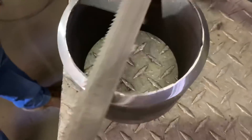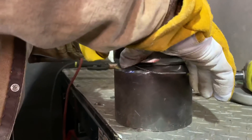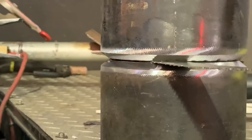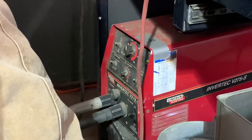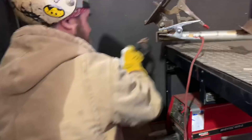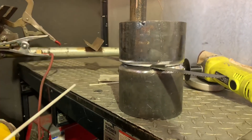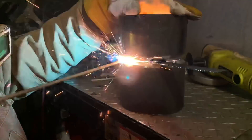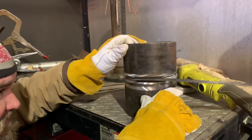We'll be running this in the 5G position, so that's a little different from the 6G. Most everything out in the field is 5G or 2G — there's not a whole lot of 6G welds in the field. I think the testing facilities are able to save companies money by using the 6G. When I was coming up in the Navy, to qualify in every position you had to do a 2G and a 5G — there was no 6G.